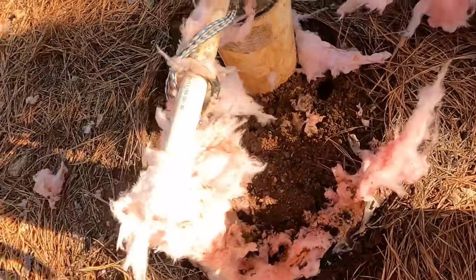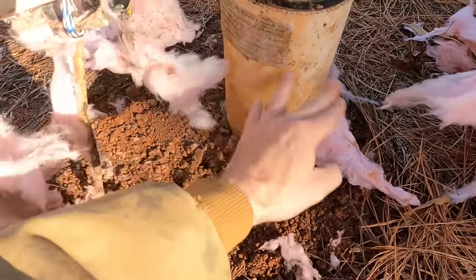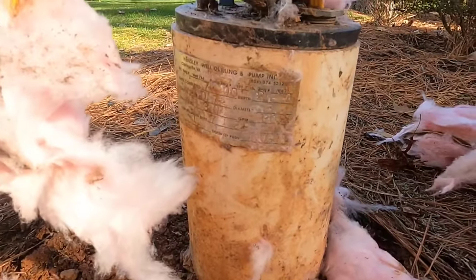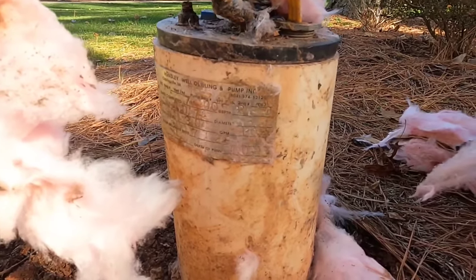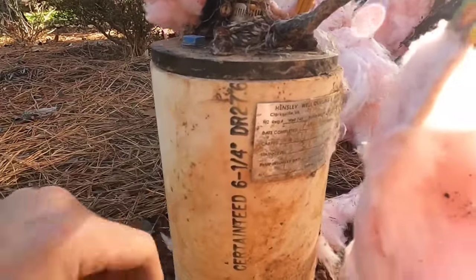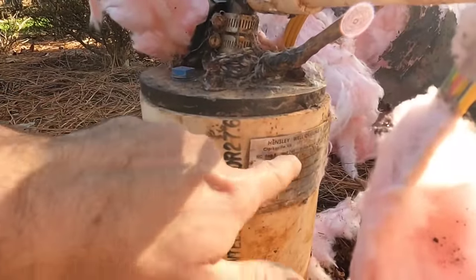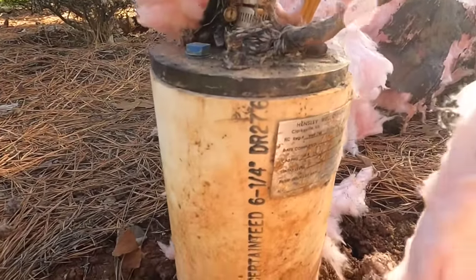She said that we had drilled this. I wanted to see when. Okay. It says July of 2000. It's 230 foot deep. And it has how much casing? Can't really read that. 107 foot of casing. Yeah, a liner is not going to fix this well. It already has a boatload of casing in it.